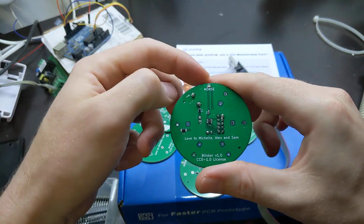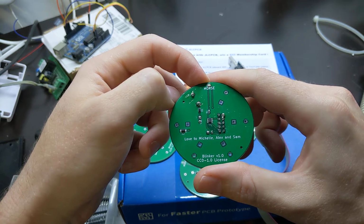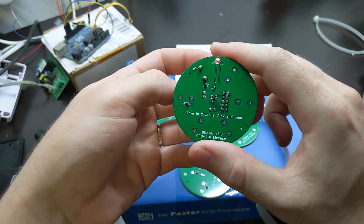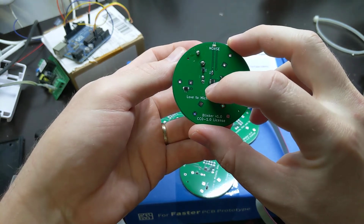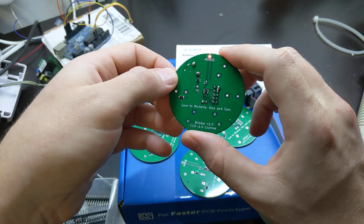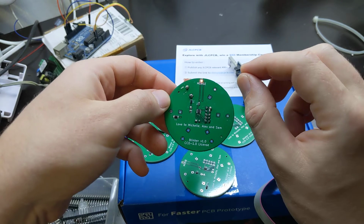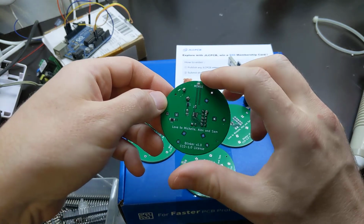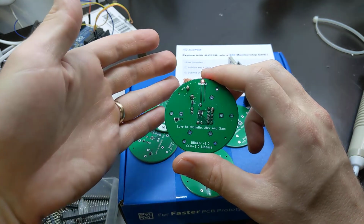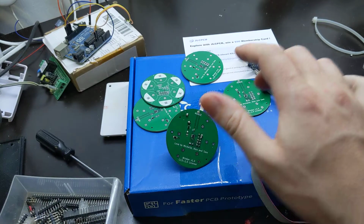Right now it's just blinking out a Morse code message at a very slow rate. It's just saying SS. That's it. The code that's running on here is quite primitive at this point. It doesn't use any timers or interrupts or anything. It's just spinning its wheels while it's doing the sleep, so it's not very power efficient. Ideally, it would go into a sleep mode, wake up, read the next bit off the Morse sequence, write it to the LED, then go back to sleep. But for now, I just wanted a simple approach. That's good enough. If you can't tell, I'm quite tired.